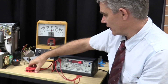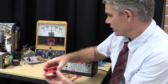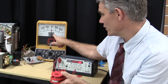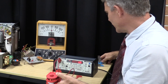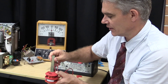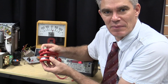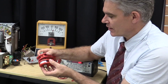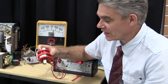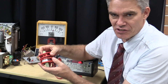Let's have a look — here we go. See the tiny little movement? It's not much, but there's a tiny little movement there. That's because I need to intensify the magnetic field through the two coils. So I've got an iron bar here — by putting the iron bar, it links the magnetic flux between the two coils. Now this is actually a transformer — it's a one-to-one transformer. The voltage in is equal to the voltage out, and it can be used to isolate an electric circuit.